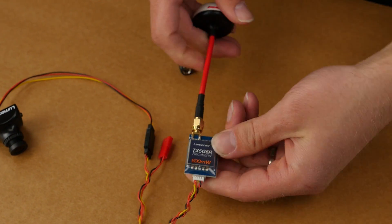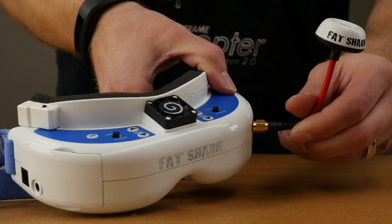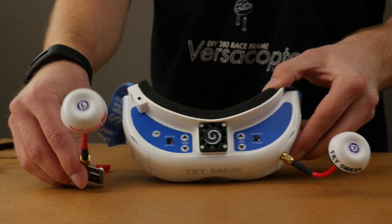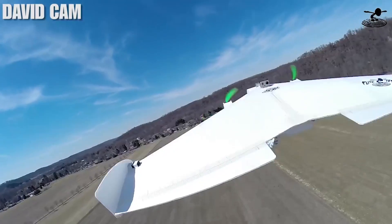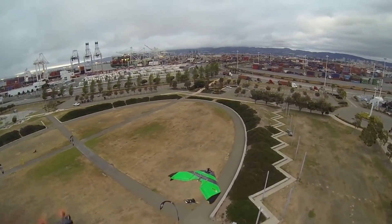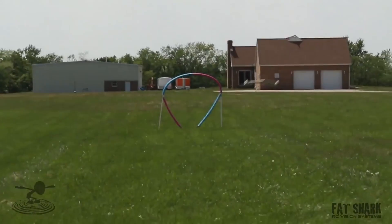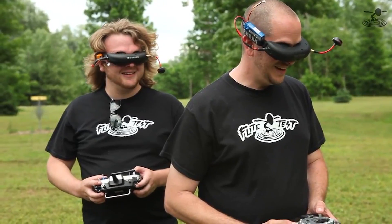We have more videos on how antennas work that we'll link below, but in short you can fly all around yourself with a cloverleaf — it sends the signal out in a rotating fashion, kind of like a drill bit going through the air. You want to make sure that if you have a right-hand polarized antenna, you match it with another right-hand polarized antenna. If you go right to left they'll actually cancel each other out and you'll get a muddy image. The reason they have left-hand and right-hand is so that with all these different channels you can stack pilots closer together with different orientations to fly more machines at the same time. You can also mix antenna types for range — using a patch antenna matched with a compatible receiver antenna.